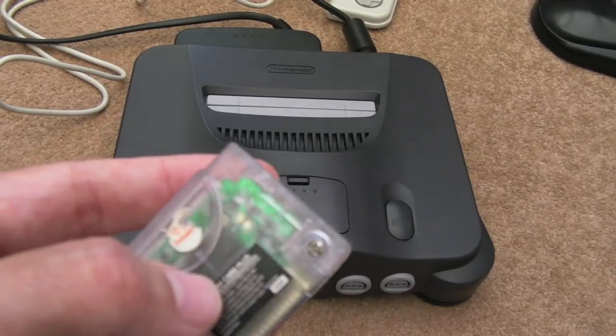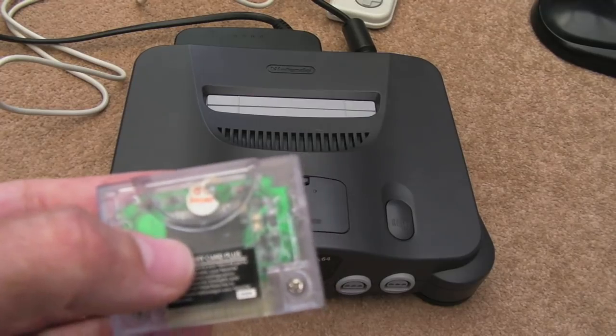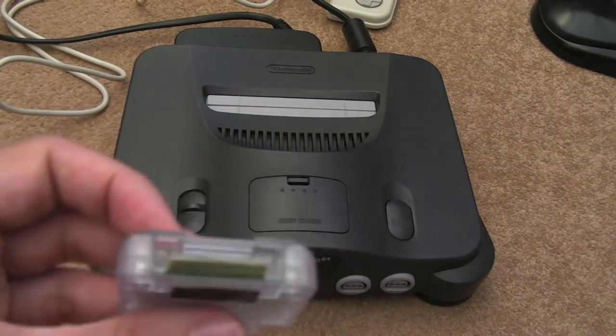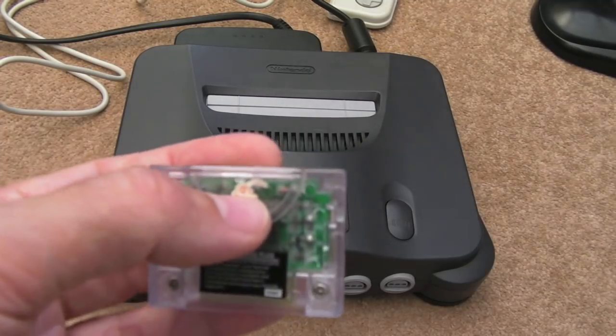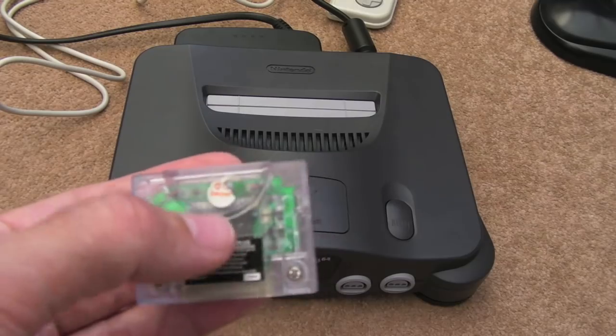I think that's why these cheap third-party ones fail. Because the chip that's on there is actually pretty good — it's a Sharp one or something. There's nothing wrong with the chips on these. Yes, the PCB quality is awful, the assembly is poor, there's probably no quality control done even though it says QC on there. But the RAM chips are good branded chips.